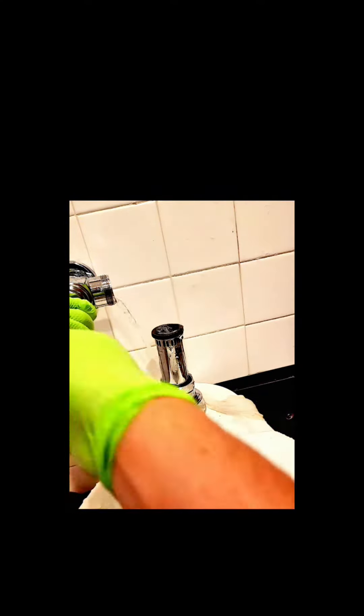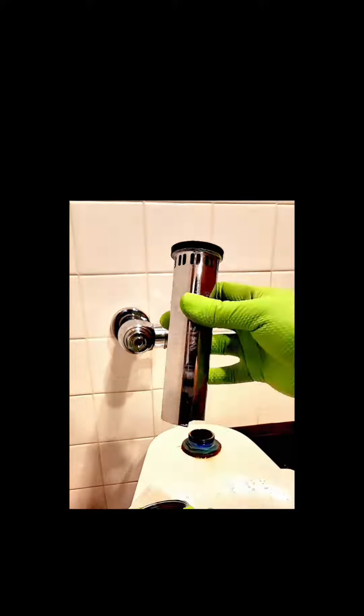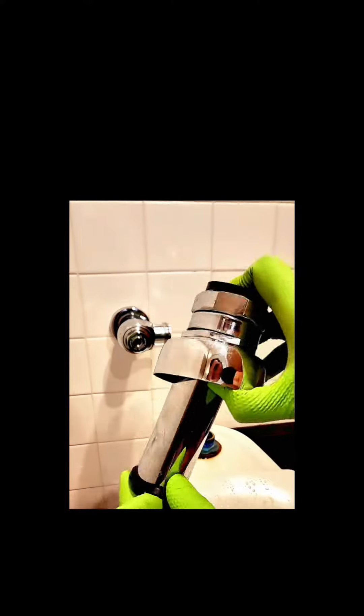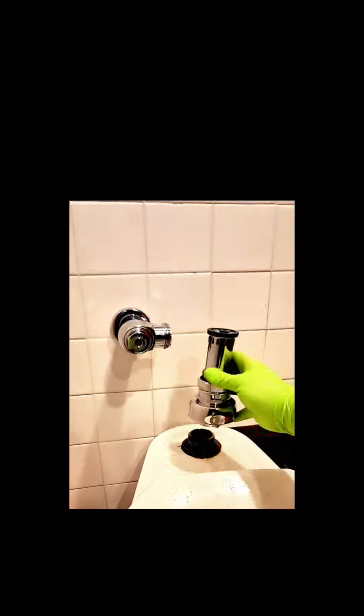I was finally able to turn the water off, and because we ain't no quitters, we're going to show you the rest of the video. We're taking off from the tailpiece and putting on the gaskets, the tightening nuts, making sure everything goes back in place the way it's supposed to. I like to add plumber's grease on the gaskets and the rubber pieces because it makes it easier for the next guy to work on it — and the next guy could always be me.